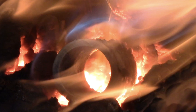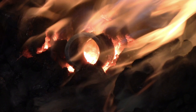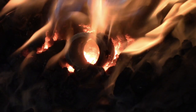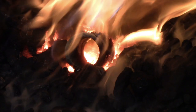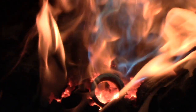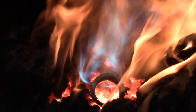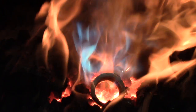The bright blue flame that you see is the actual zinc burning off, and that greenish blue flame will intensify as the piece gets hotter. The effect that you're seeing here isn't anywhere near as dramatic as you would get when you're welding, and that's because the pipe is being heated up very slowly compared to the quick intense heat that you get when welding. Also the flame from the fire is consuming all of the white smoke that you would normally get when you're welding galvanized metal.